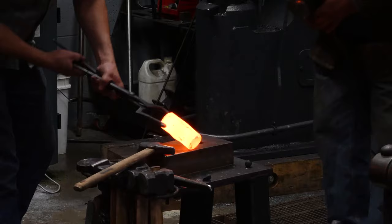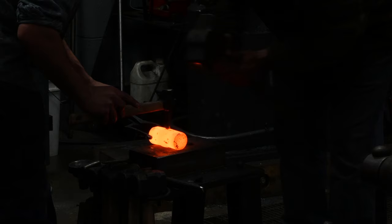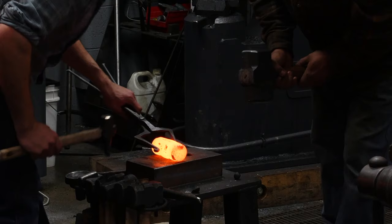Now I have two lines. And these two I have to divide apart very accurately to line up with the other hole. Rob just gave me what's called a pin prick. Very, very light hit. The reason he does that is because I need to be able to move the mark if it's not in the right place. It's in the right place, so he's gonna hit slightly harder.